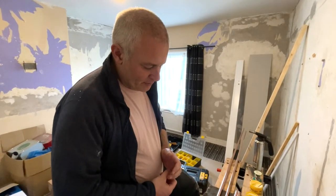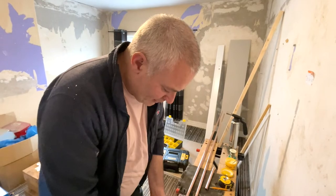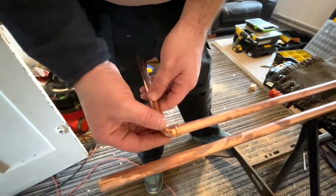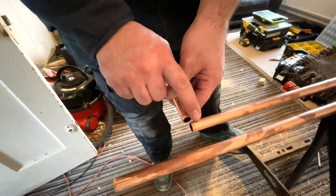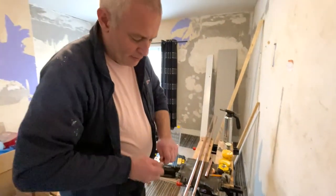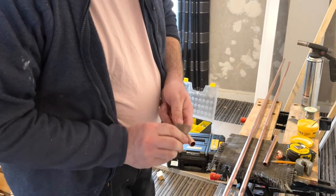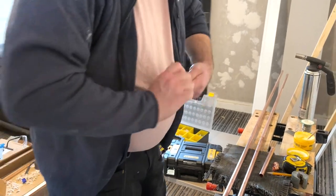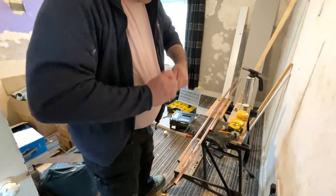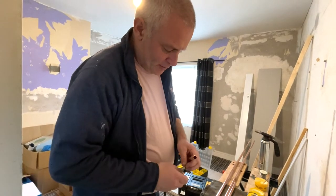So what we've got to do is join two pieces of copper together on a right angle. We've got a fitting here and some copper pipe. We've used our pipe slice as we did previously, cut 200mm off the end. I'm going to attach these two bits of copper pipe. You can see where the pipe slice has been cutting through it's dirty, so again we go back to our little bit of emery cloth. Just rub this around, make it nice and shiny. You should always have a nice polished end. It's actually putting very tiny grooves in the end, which is why we're going round and round rather than backwards and forwards, and that's going to help the process of soldering.